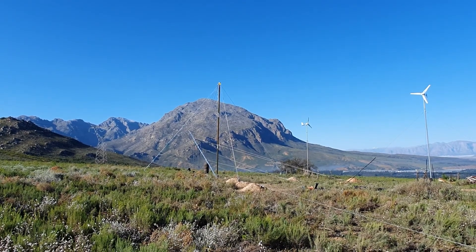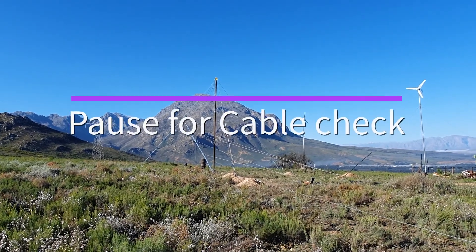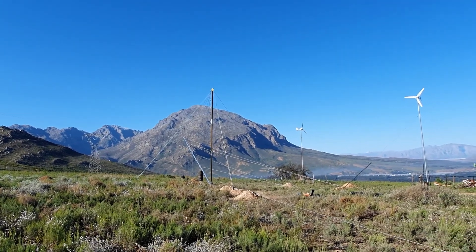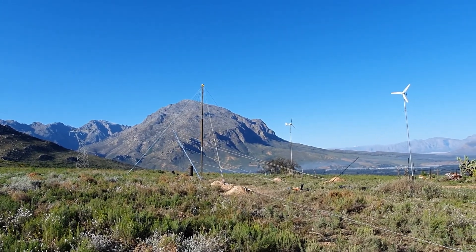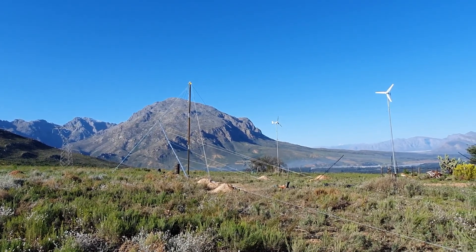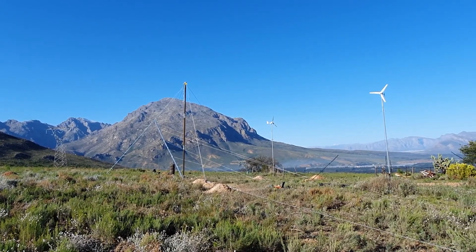The gin pole is not left on site — it gets taken off. You'll see I stop every now and again to go and double-check all the cables running off to the sides haven't over-tensioned. It's really important that you do that, because that can happen and you don't want anything breaking while the whole thing is coming up.